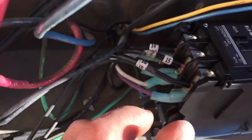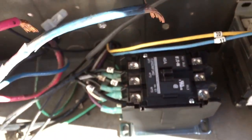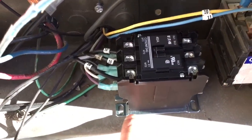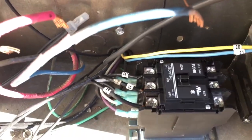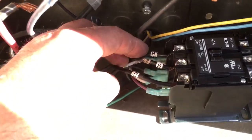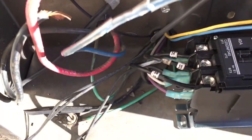That way you can see how the wires go in and get everything nice, because it's really difficult to see upside down. You don't know if the wires are in, but you can get them a lot better. You can use your screwdriver directly down on top of them, and use the metal to support yourself when you're doing it — it goes a lot faster. I do my phases because these weren't colored, so I just do 14, 15, 16 — any numbers you can remember.